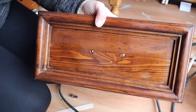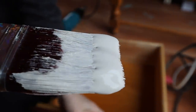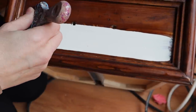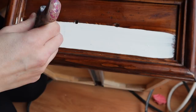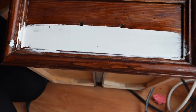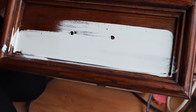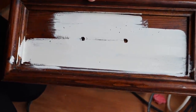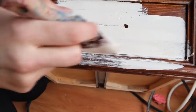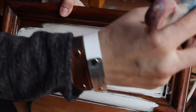On this drawer front my crackle is dry — you can see how it's a little bit shinier in some spots. Load up your brush with just a little bit more paint because you only want to go in one direction. You do not want to back brush because you will erase the crackle. Go in one direction and don't overwork it. You can dab a little bit if you need to fill in spots, but start at one end and only go over it twice, then leave it alone. If you mess with it too much you're going to mess with the crackle. As soon as the paint touches that crackle medium, that is when it's going to activate. Trust the process because it's going to look really crazy at first, but I'll show you how to fill it in and make everything look more organic.